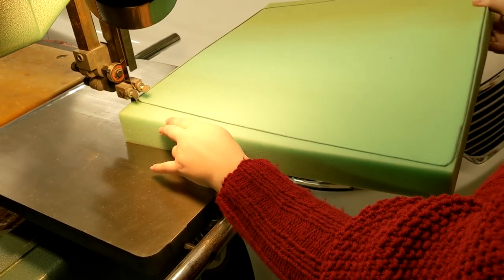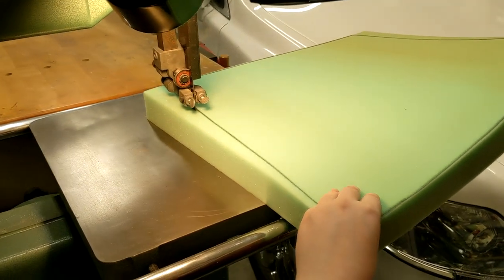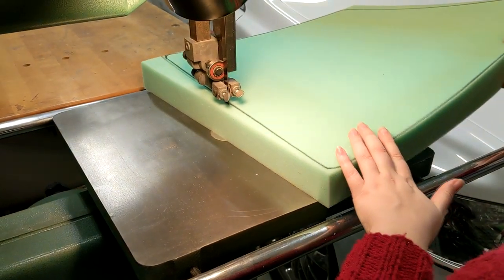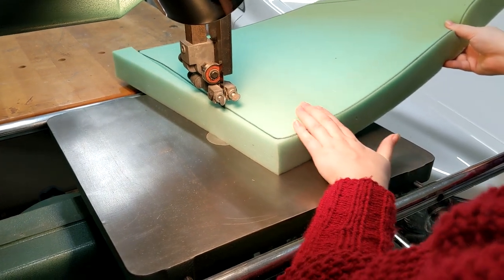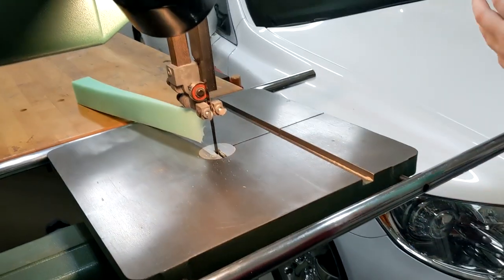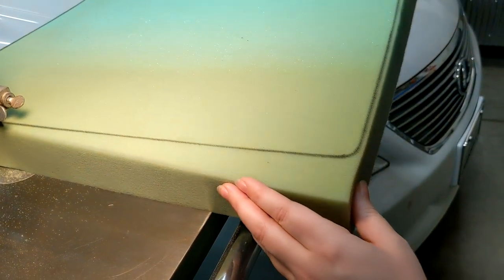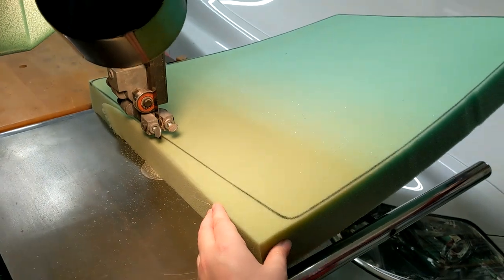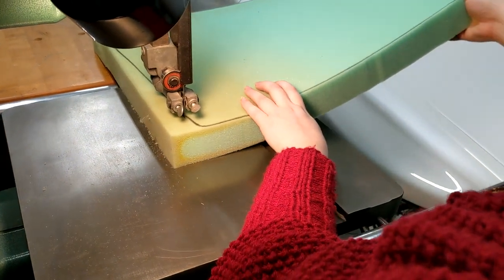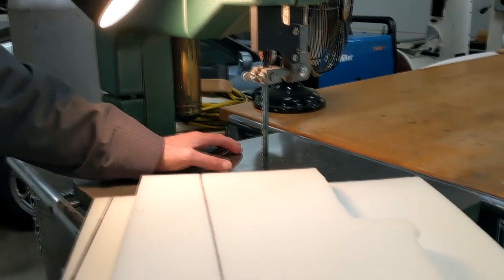My turn. Keep on the outside of the line — you're too close. I'll give a little bit too wide a berth. Better? You should be wider from the start. I'll fix it on the other side. Keep your hand away from the blade — no closer than that. We're too close again. So we have the blade higher for the thicker material, and I'm raising this up purposefully to make a point.